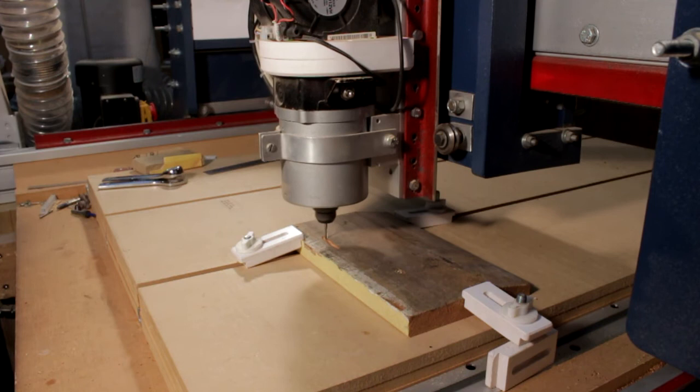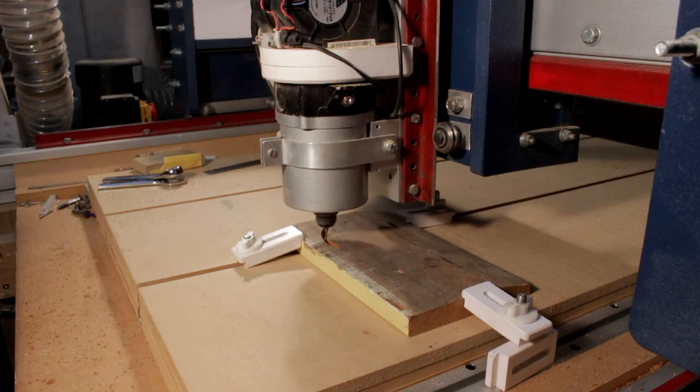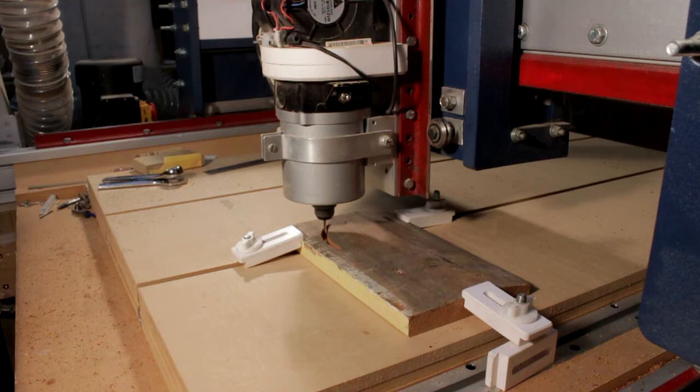As you can see, I've started by machining the groove for the nail holes first on this model. Because I haven't leveled the whole piece of board off, I actually have to dig my way down 8 millimeters to get to the surface of the horseshoe, and then follow that up with another 3 millimeters, which is the depth I want for this particular groove to start with.